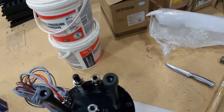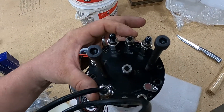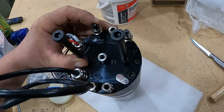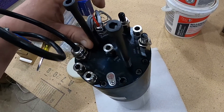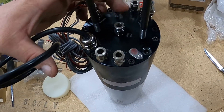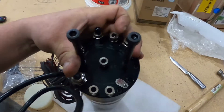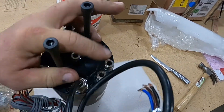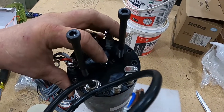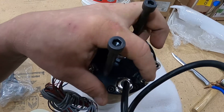It's got water - so you've got your water inlet, your air, and your water outlet - inlet and outlet. It's also got a heat sensor that detects overheating. Your air inlet - I think that's to remove the collet. There's dust removal right here and here's your air return - and this one is to release the tool head.